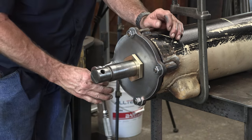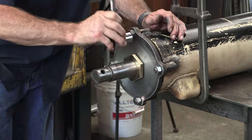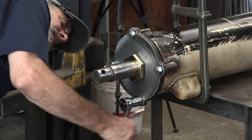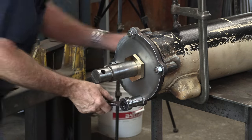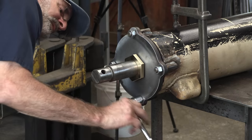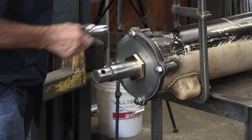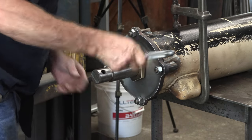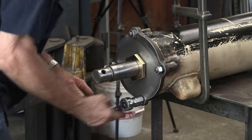All right, got my ratchet, and I brought this down, so I'm eyeballing, and I am just really being careful that I'm bringing her all in at the same amount. There's a taper leading edge there, and everything is lubed up, so the O-ring compresses in the way it's supposed to. If you had it cocked or something like that, it might lead to that O-ring malfunctioning on you.